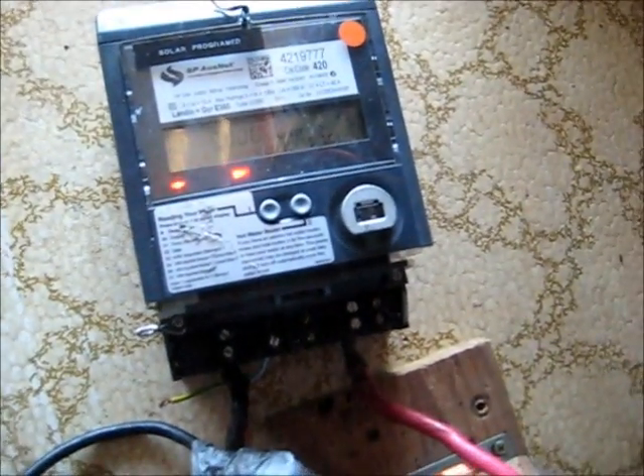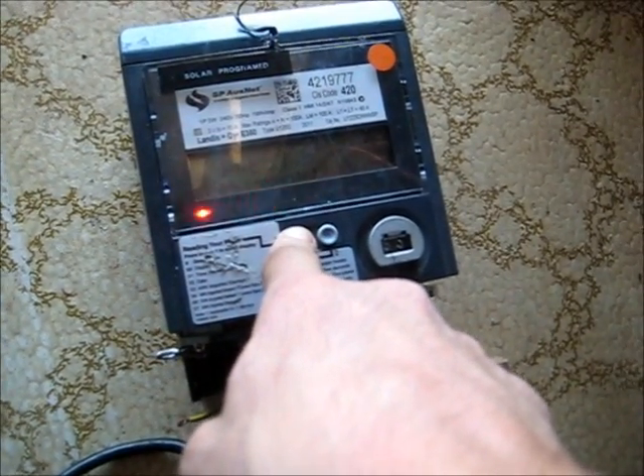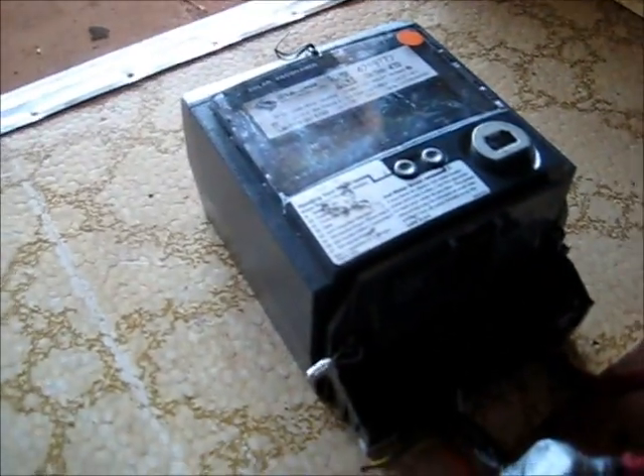The windings are getting too hot before the smart meter does. Kind of zero — shut everything down. That experiment now, I used about half right between those two indicators, so it's advanced about 50 watt hours. Unplug, safety first. This bloody winding is getting too hot — if it shorts here, not only is it going to be a high current short, it'll short this isolation transformer out. I don't want to burn this transformer out. Look how hot that got — got duct tape melting onto that. I need a better way to overload this thing. See if anyone else has got any ideas. That'll be enough for now — thanks for watching.